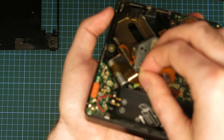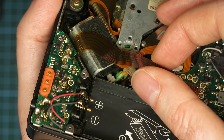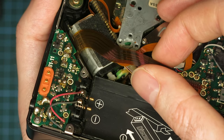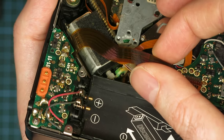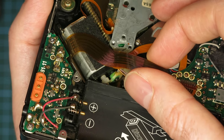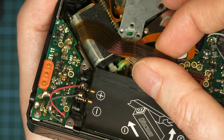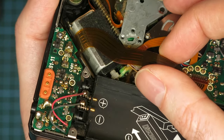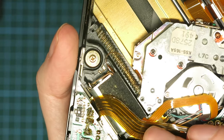I'll recompose the shot to show you what I've just spotted. Hopefully you can see where my thumb is — there's a white gear on the motor and then a green and yellow gear, and a chunk has snapped off that gear. The little one on the motor and the one in the middle especially are the ones known to break. I was expecting a split around the shaft but wasn't expecting a chunk snapped off. That obviously means the motor will be just freewheeling because the teeth are not meshing. Definitely going to need to order some gears.